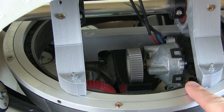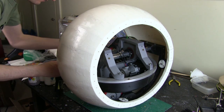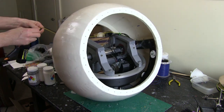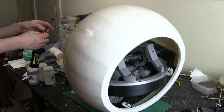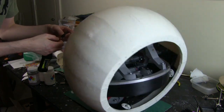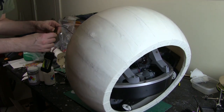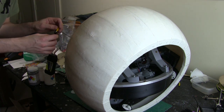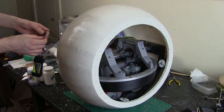So now I'm just going to power this up and we'll see, hopefully, that this moves side to side. I'm just going to stick this battery on that motor and hopefully it should lean left to right okay, so let's try it that way. Yep, there we go, it seems to lean more than enough, I think, for stabilising and steering. Let's just turn that round. So that's, yeah, back the other way. The rubber gear does skip if it goes past the end stop, but it's going to be measured and restricted, so it can't do that in the end, and also stabilised. So the same as I had front to back in the last version, I'll have side to side stabilisation with an inertial measurement unit in this one. So there we go, and back to the middle.